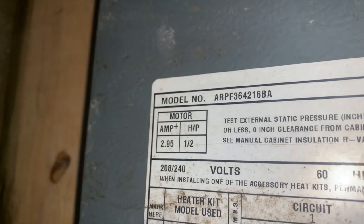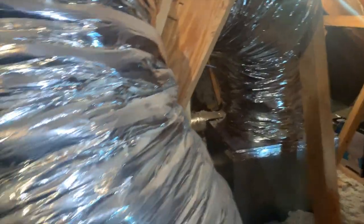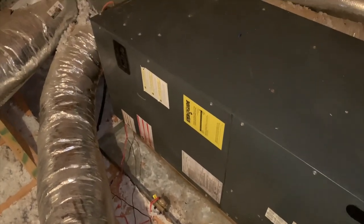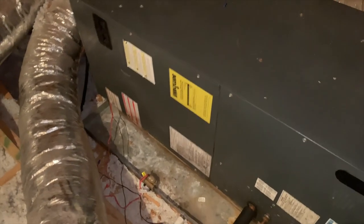You can see some sweat there — refrigerant line is cold. Already checked his refrigerant when I did the service. He also had a weak dual run capacitor that we replaced. This is a three to three-and-a-half ton air handler and he's running a three-and-a-half ton condenser with a 20-inch flex duct for the return. Normally they undersize the flex on the return, but 20-inch will definitely handle three-and-a-half, so it's good to see. She's back online. Thanks for watching — we'll see you guys on the next one.